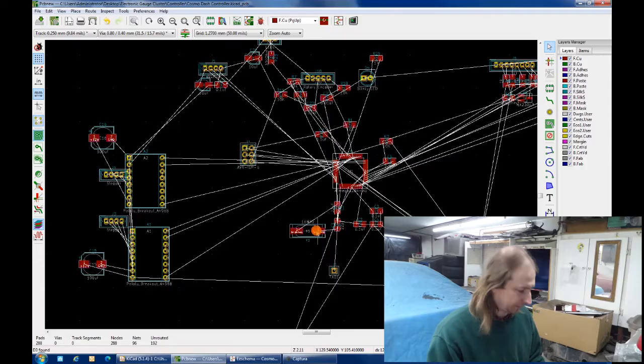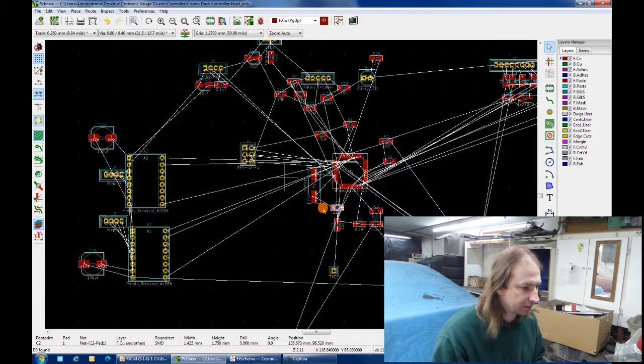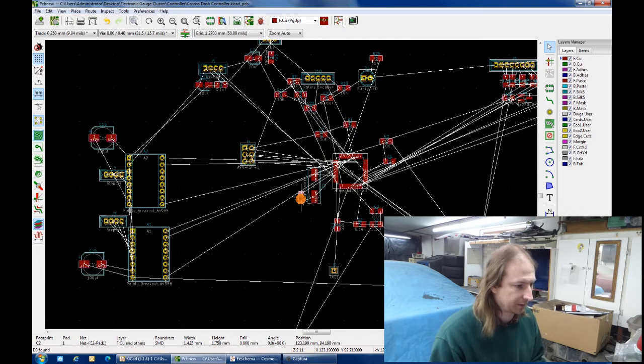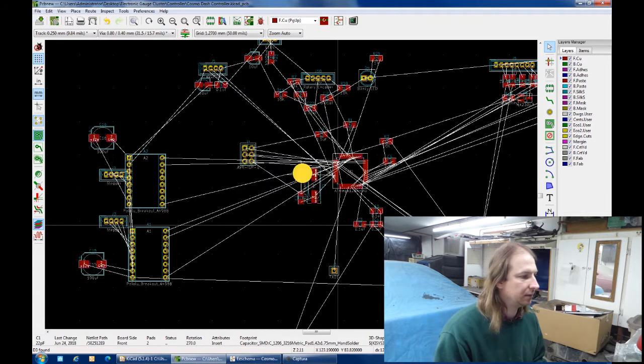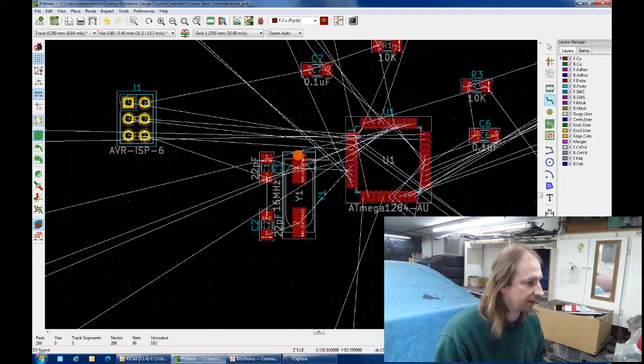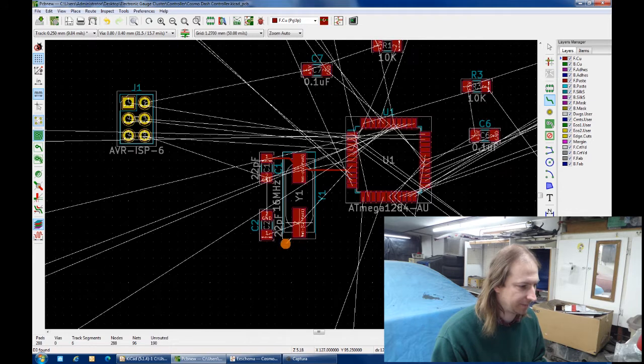Well, now that everything's in place, I can actually start connecting things with traces. What I like to do is start with the most obviously placed parts first, like for example the crystal. It needs to be close to the processor, and it needs its 2 capacitors. I tend to shove them as close to one another as possible and connect them with traces. I like 9.84 mil traces because, honestly, they're really small, but they're typically the cheapest traces PCB fabs can do.